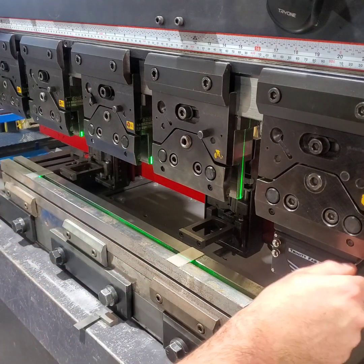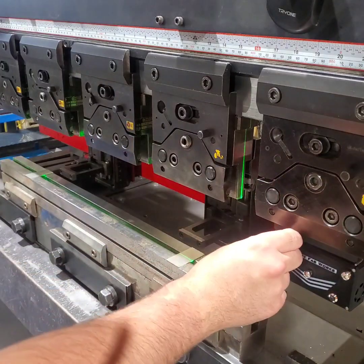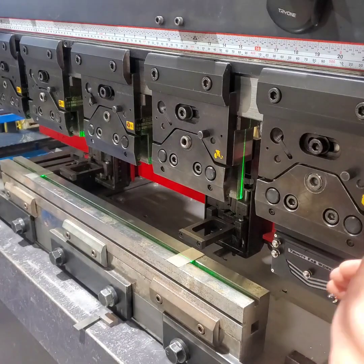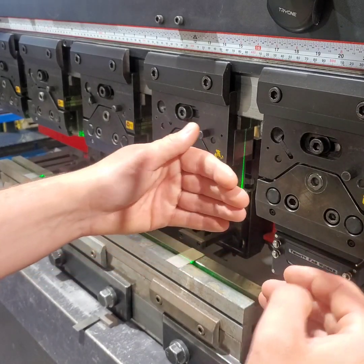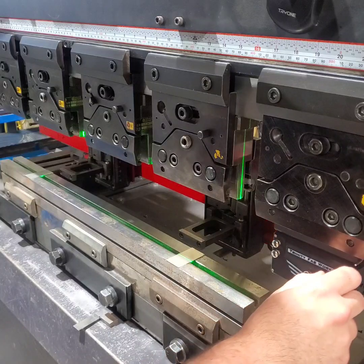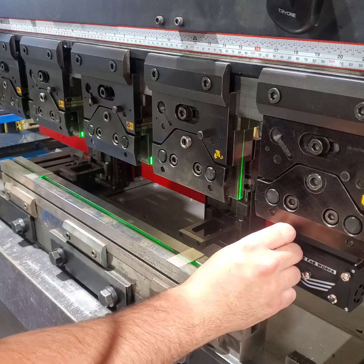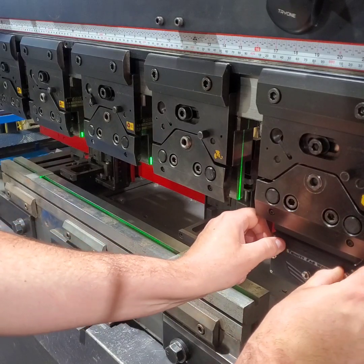Dialing it in at first can be kind of frustrating until you figure out what you're doing. What you want to do is try to line these up with both lines across here, so adjust the back knob to get it semi close - looks like we're good on this one, we're a little too far there. Go back and forth until you can get it squared. What it's doing is this part is moving the back in and out and this knob is moving the front in and out, so you can move both at the same time to move it parallel, or move one or the other to move it back and forth.